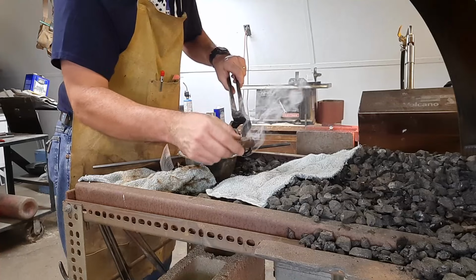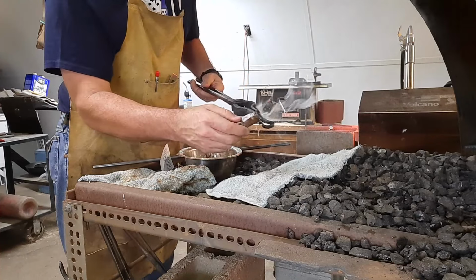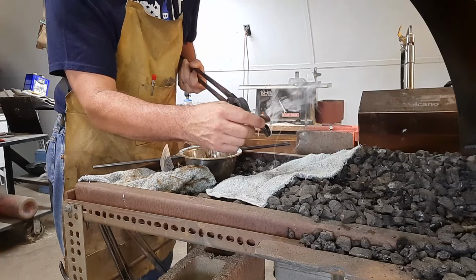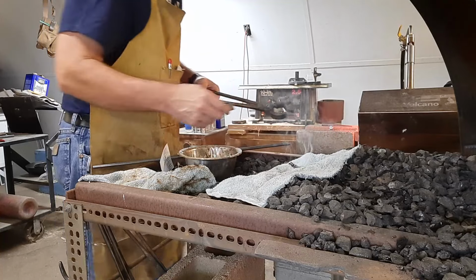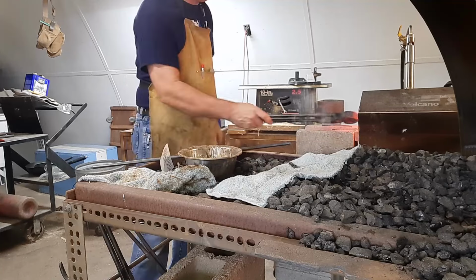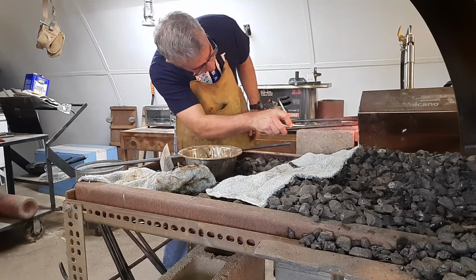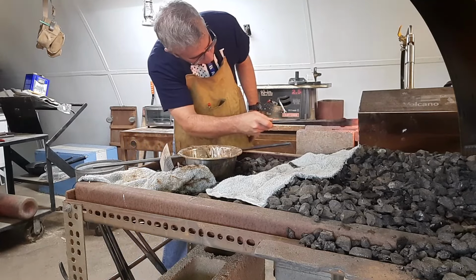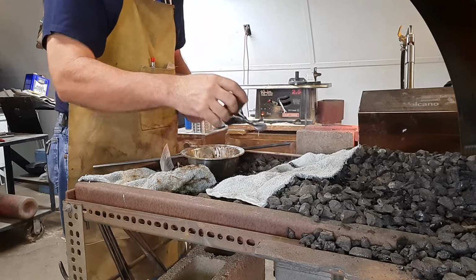And what that does is that beeswax gets down into the pores of the metal, and it keeps it from rusting as fast. It also gives it that nice black patina that we always like when it comes to forged materials. And I didn't have to pay for anything outrageous as far as having some finishing solution. It's a natural finishing solution. It does a good job. So I just use that, a little leftover wax from the bees, and one hobby helps the other one.